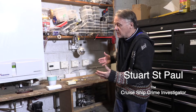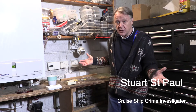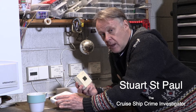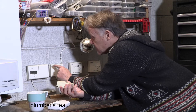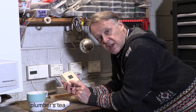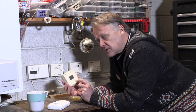Central heating is a system that pumps water around the house. In order to do that it has to be switched on or off like a light switch. You could have a thermostat on the wall which is hardwired, but nowadays radio-controlled receivers and senders are kind of the norm. Inside here, this receiver has a little aerial and it responds to what the sender says. If it's all live you can see it's on — it doesn't need new batteries, but that could be the first thing to check.